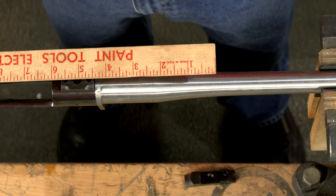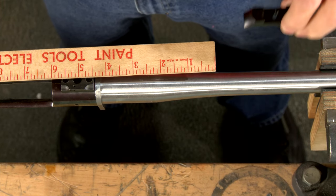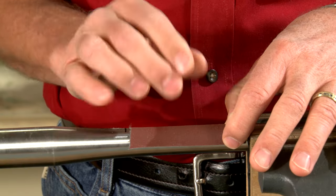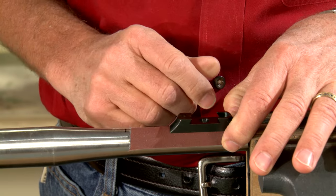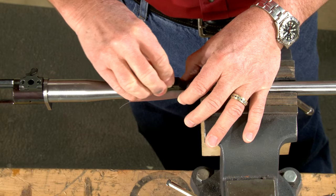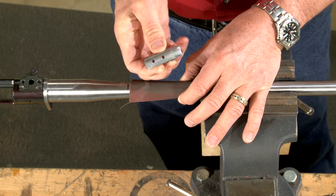The leading edge of the rear base should be located about four and a quarter inches from the front of the recoil lug. The best way I have found to match the contours is to place a strip of abrasive paper on the barrel so the dimensions of the wrapped barrel are the same as the bare metal where the rear sight will be located. Carefully sliding the base back and forth with moderate pressure will open up the radius to match the barrel contour perfectly.